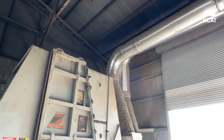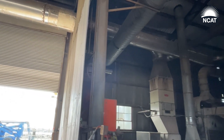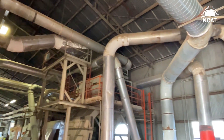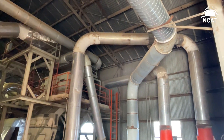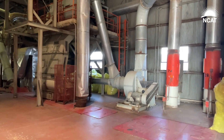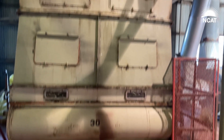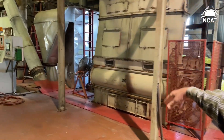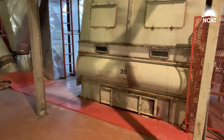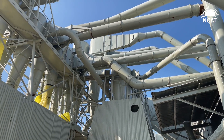We're going through some pre-cleaning. Air comes over from a burner fan — we're not using any heat — pushing through that back line, and the material coming into the gin is on this front line, being sucked. This is called a separator; the unloading fan creates the suction to pull. We're pushing and pulling the material to the first machine up on top — the incline cleaner, just a scrubbing. What gets through that cleaner drops down through the ductwork, through a vacuum that separates the air from the material. We're pulling the trash side, which is deposited in one of the cyclones outside, and we're collecting that material.